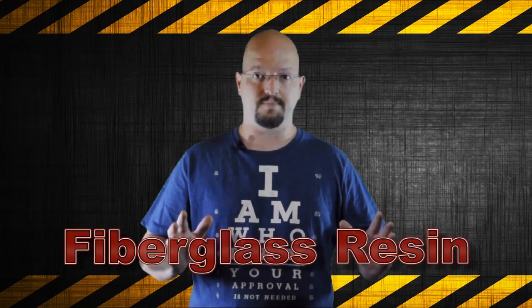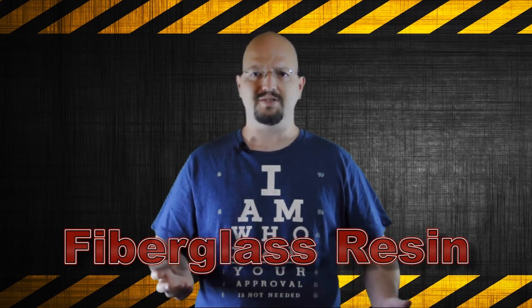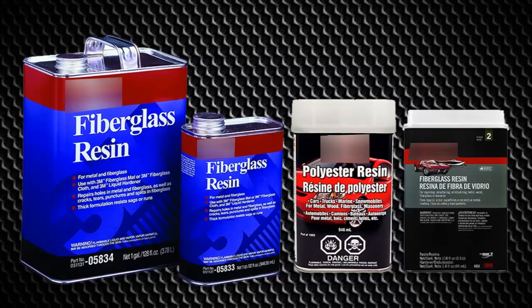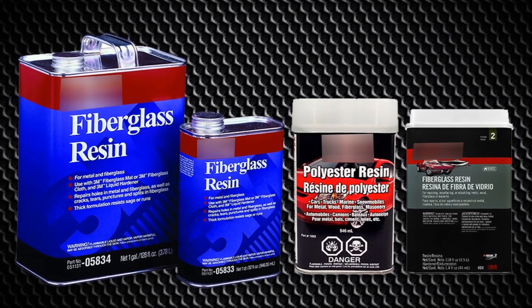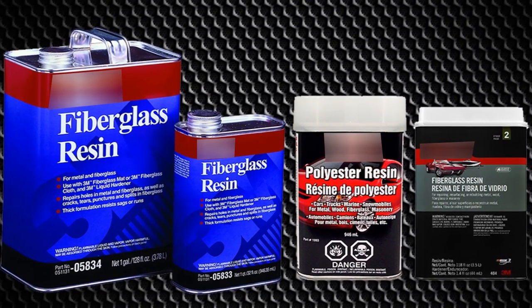First, let me start with the name in question, fiberglass resin. Now, the name itself can be very misleading because the material itself doesn't contain any fiberglass at all. When 99% of people say fiberglass resin, what they're really talking about is polyester resin. Everyone has seen this stuff at one point or another on the shelves in stores. More than likely, a lot of you have at one point or another purchased one of these products.